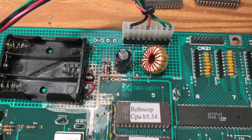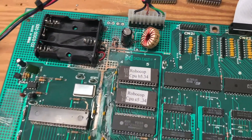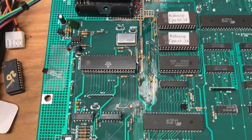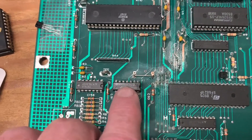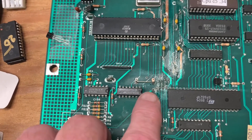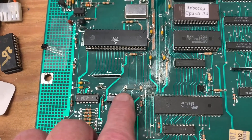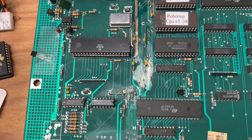There was a lot of corrosion in that area and I wanted to make sure it was at least getting good clean power to operate. I removed the jumper that selects the clock coming out of this LS107 — it was all green and corroded — so I removed it, sanded down to bare copper, and placed a new jumper in there.